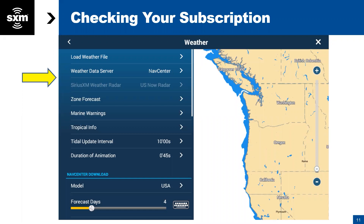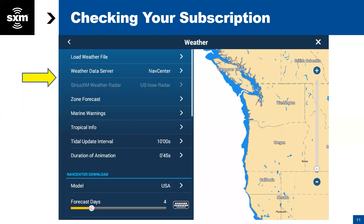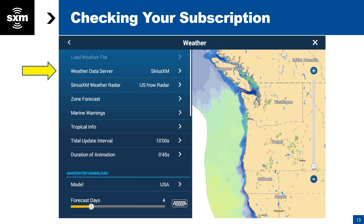A lot of people think because it's satellite-based that SiriusXM is worldwide, but it's not. Our satellites are geostationary — they're hovering over North America at all times, and that's why we have that satellite footprint shown earlier. So what you'll need to do with your Furuno is choose the SiriusXM weather from the menu. Once you have that, you're going to see your weather elements listed, but just make sure that the weather data server is set to SiriusXM.